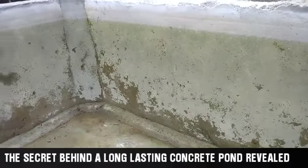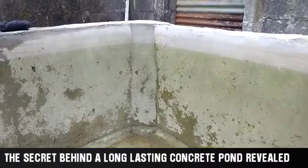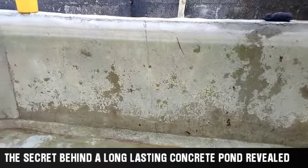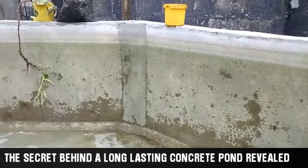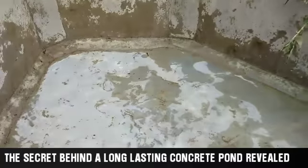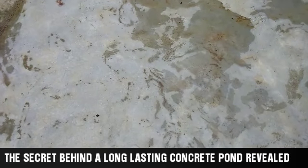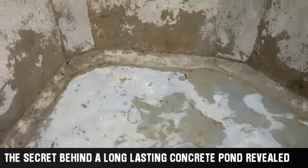As I said earlier, you don't just bring in anybody to construct your pond. It must be someone who has at least done it before, someone with the idea. And if the person doesn't have experience, from this video you should be able to tell them exactly how to construct your pond — don't let them do it their own way. Tell them: after making the corner 90 degrees, this is what I want you to do, and this is how I want the ground to look. The ground itself must be smooth — very, very smooth. The constructor must shine the floor.